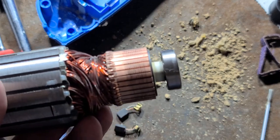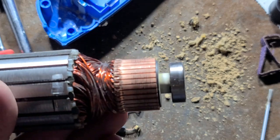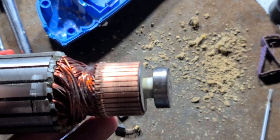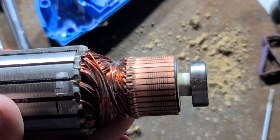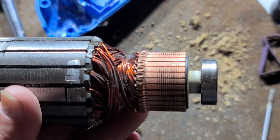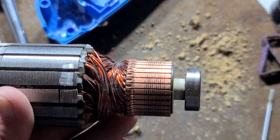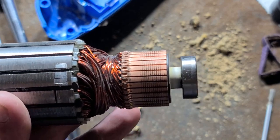It is copper — it is soft, but not quite as soft as you think. It's a copper alloy because the idea is that the brushes are supposed to wear out while causing as little wear as possible on the commutator while maintaining high conductivity. And a lot of the wear isn't just mechanical scraping — it's electrical. There are little sparks happening between the brush and commutator, and those little sparks cause electrical discharge erosion, which is probably where half the wear comes from.